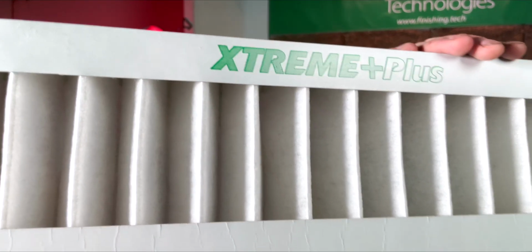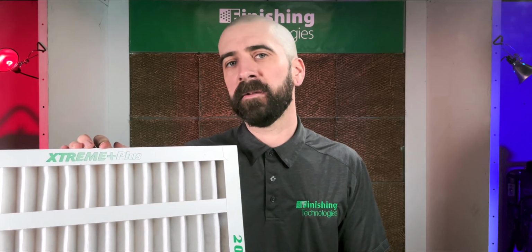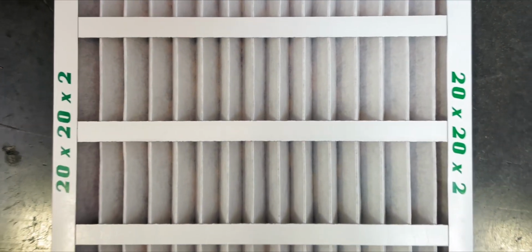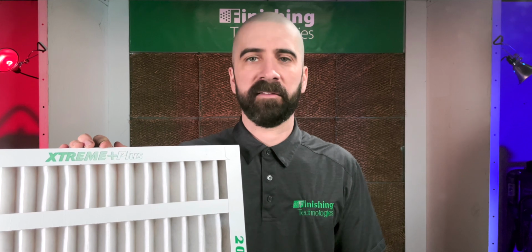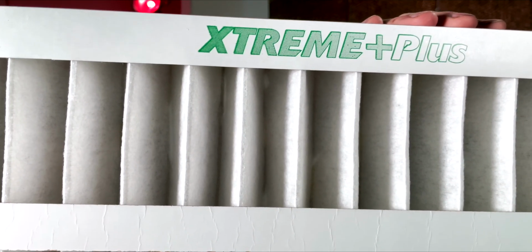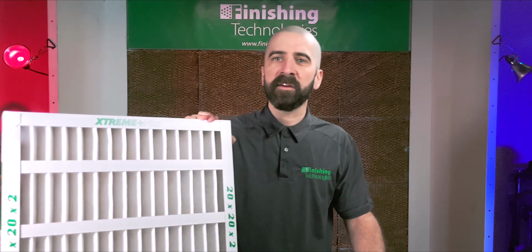First of all, let's talk about pleated filters. These types of intake filters are very common. You probably have them in your home HVAC system and are quite good at filtering particulates that naturally end up in ambient air. They can also be inside your paint booth intake system and come in plenty of sizes. The filter material is folded up, pleated, and glued inside a rigid cardboard frame in most cases. The material is pleated in this way to increase its surface area so that a high volume of air can pass through efficiently, yet media thickness doesn't have to increase to get good filtration.